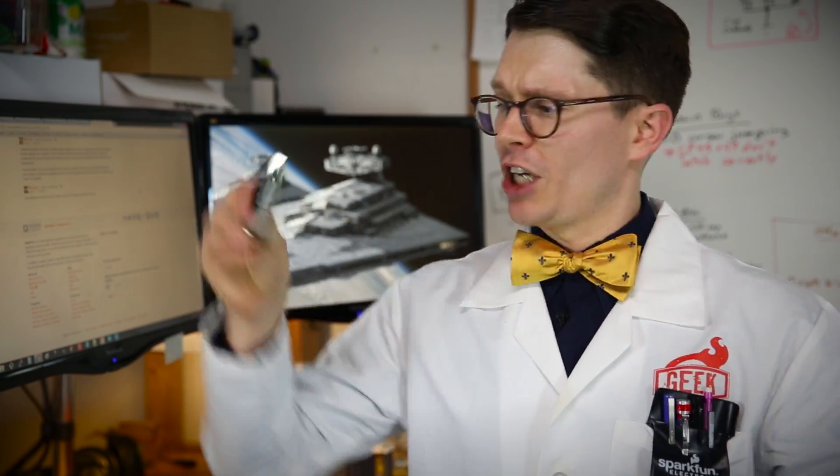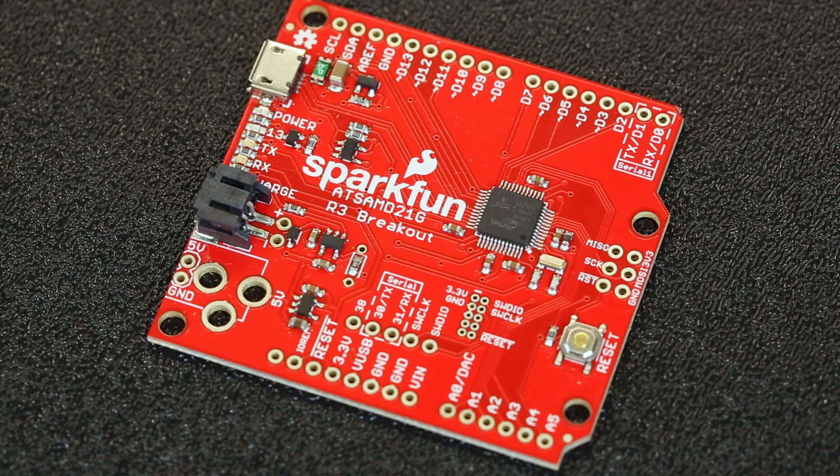The 101 comes pre-programmed with a real-time operating system, which Intel plans to open source in the very near future. The board itself is a useful tool for learning embedded electronics, much like the old Arduino UNO. The addition of sensors and the Bluetooth radio means that out of the box you could make a gesture and motion controller for a smartphone app. The addition of the 32-bit processor means that it's a viable rival to things like the SAM-D21-based Arduinos, meaning you can use more powerful peripherals like larger LCDs or quadrature encoders, and it also opens up the ability to use multi-threaded applications.